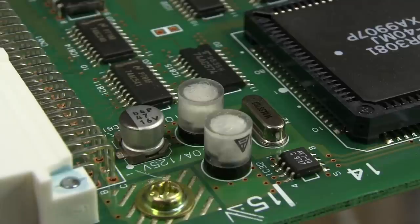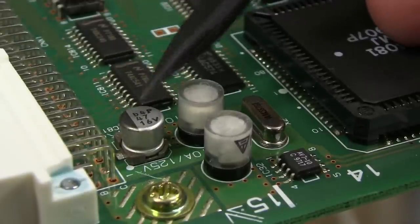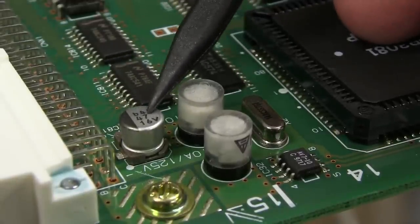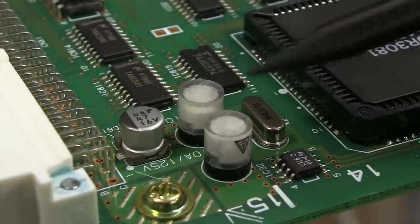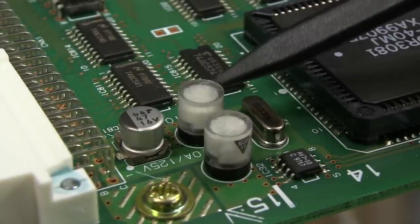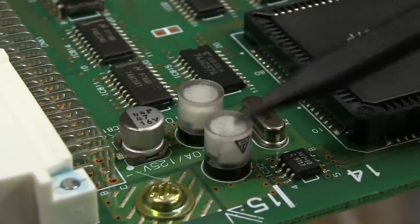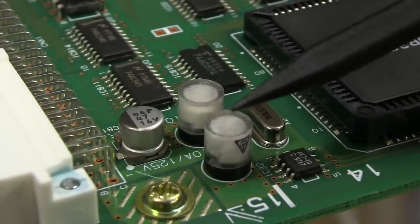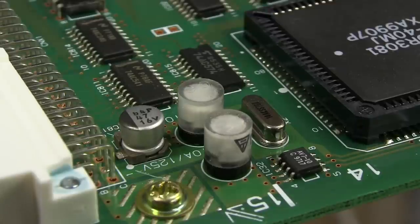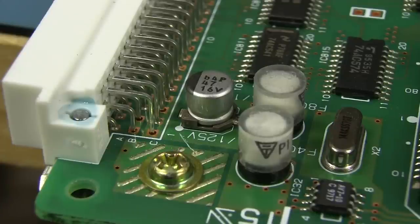Check this out. This is interesting. This is obviously part of the power input on this DIN 41612 connector here. Got just an electrolytic cap here, surface mount. Look at these two beasts. They've got like a plastic cover on them. These are actually fuses. They're 10 amp, 125 volt fuses, almost as if they've got a ceramic interior covered by a plastic outer thing. So it's almost like they're a little mini HRC, high rupture capacity fuse. I haven't seen that form factor before. Very interesting.